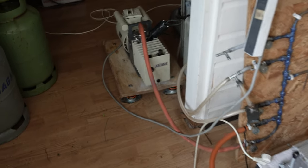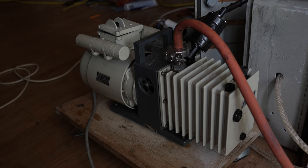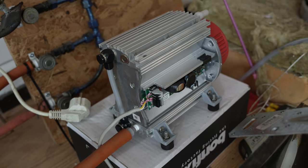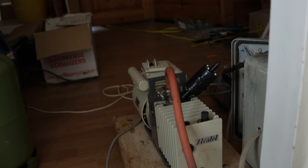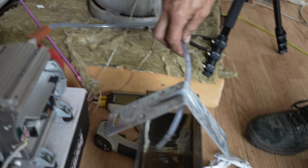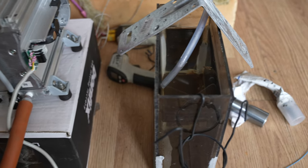This is the old pump for fast pumping of the vacuum — a roughing pump. We have now added a diaphragm pump to the system. What's special about it is there is no oil involved. The old rotary pumps have oil in the system, but with this diaphragm pump we can capture the gas coming out of the tank into a bottle.